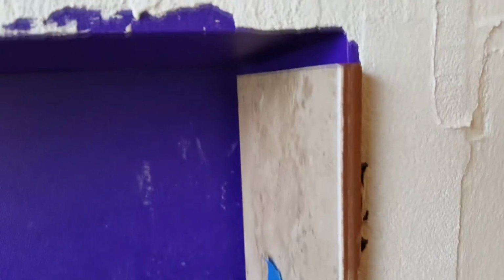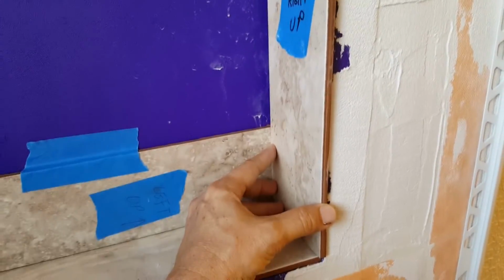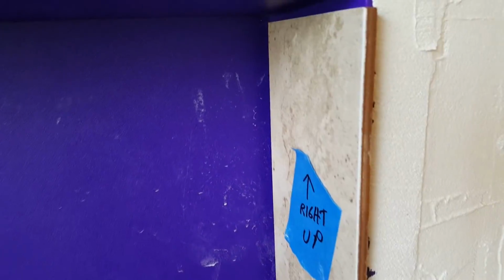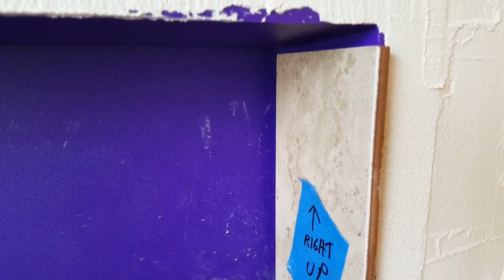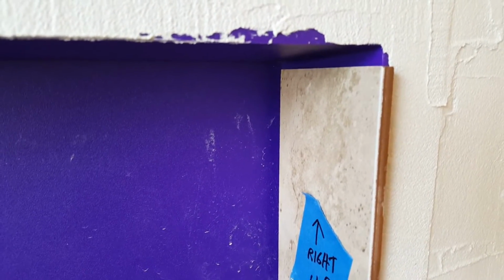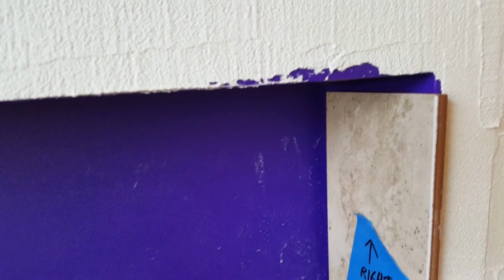So if you're going to put that top piece, some people like to rest it on top of the left and right tiles here. So I would have to cut this tile down a little further in order to give that upper piece, with the thickness of its mortar, all that distance to come down and rest on top of that. That's where the art really comes in on this. You make your cuts on the wet saw on the left and right pieces, and I guarantee you're going to be going back to the wet saw probably 2 or 3 more times to get it narrowed down. But that's really the best way to do it, to make sure that it stays completely tight to where you think the upper piece is going to connect.